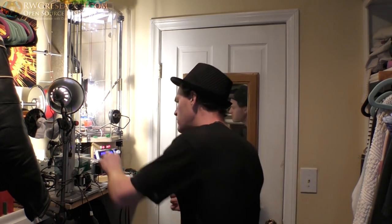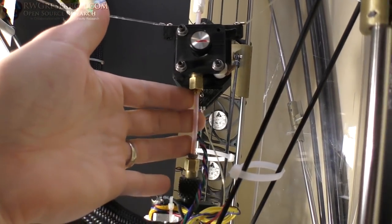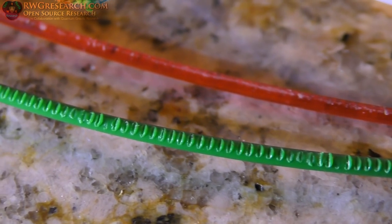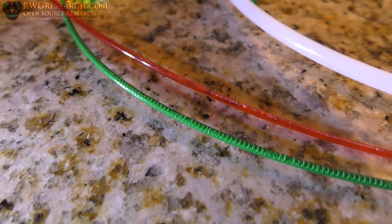And what I was actually having troubles with is on my extruder setup, you can see there's a 6-inch piece of Teflon tubing. And this Teflon tubing, if it's made to the correct tolerance, which is exactly 2 millimeter on the inside diameter, 4 millimeter on the outside diameter, when you have all these retractions, you get these little notches in your plastic from the extruder motor gear digging into this constantly up and down, up and down, and it digs a little pit into your filament.